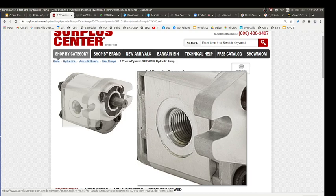I'd just say if you're trying to increase pressure, then you want the outlet to be smaller. That's the role of the pump. On an inlet, you've got suction, so you don't really have a lot of pull there, so you want a large diameter so you don't have a lot of resistance. On the pressure side, the smaller the hose is, the more pressure it can take.